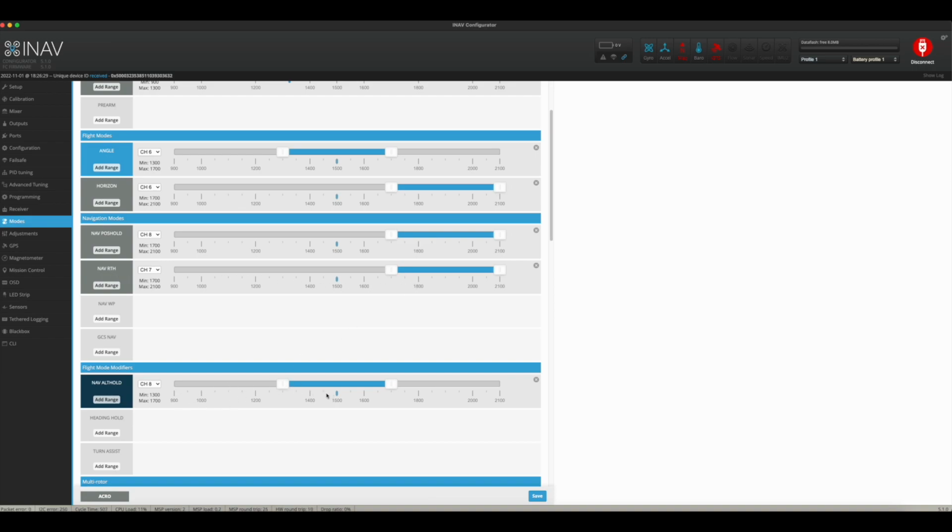And altitude hold. Now, position hold, as you'll see here shortly, is you flip the switch and the thing pretty much stays still. Stays where it needs to be. Now, you're not going to get these options right here if you don't have all the things that you need to use iNav. Like before, when I installed it real quick onto this exact quad, running my older GPS unit, I didn't have return to home or nav position hold. I did have altitude hold because I had a barometer. So that allowed for it to set itself at a certain altitude and kind of just stayed there.